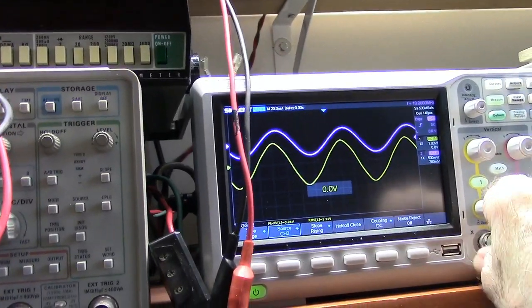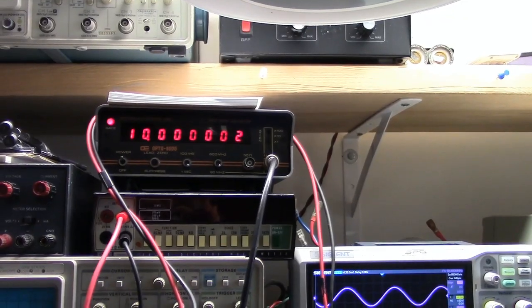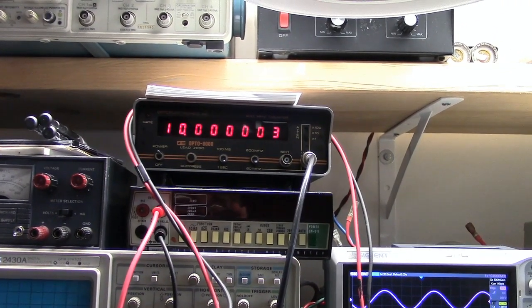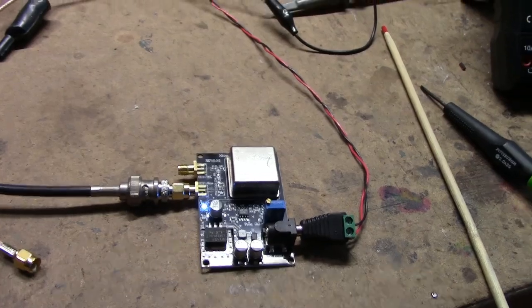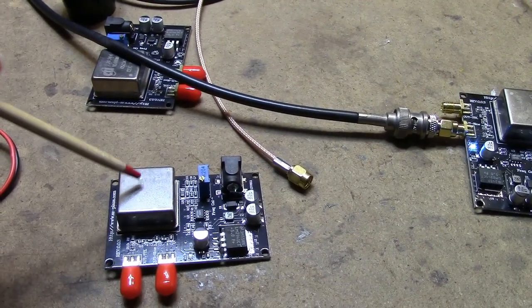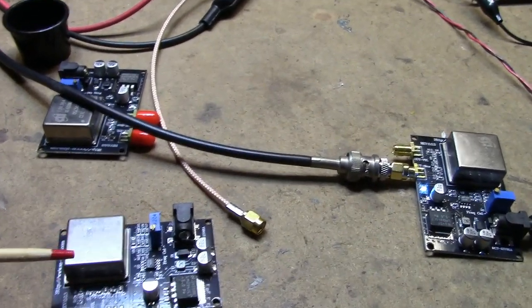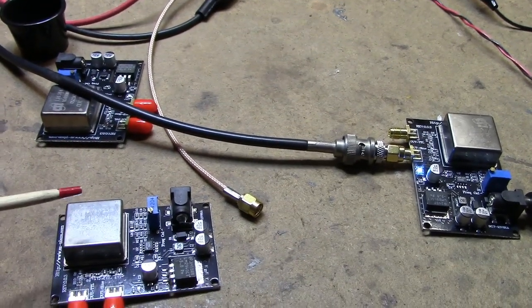Back on the frequency counter, it's now saying two to three cycles high. I just turned this on and I'm going to go by the comparison with the GPS standard — that's still pretty close. These will come in handy. I got three of them here. I also ordered 10 of the actual bare OCXOs without the board from AliExpress, so I'll play around with those. Time will tell long-term how stable these things are.